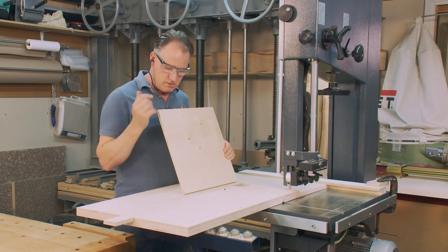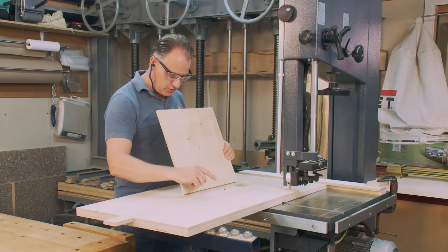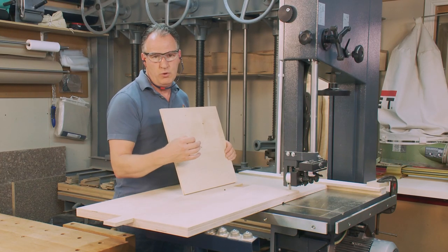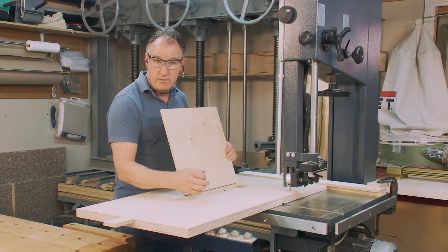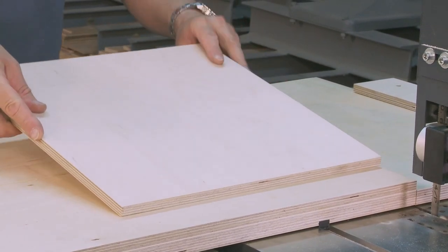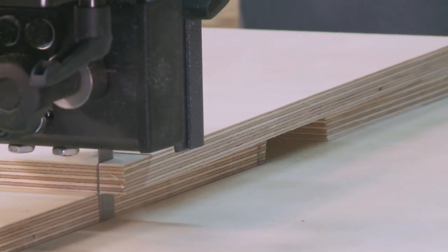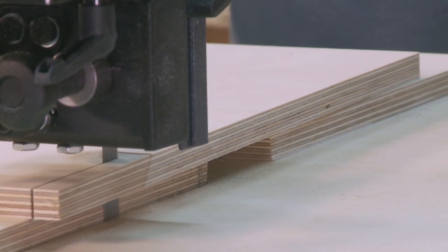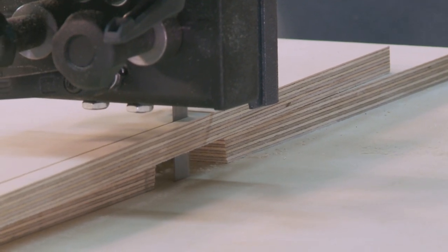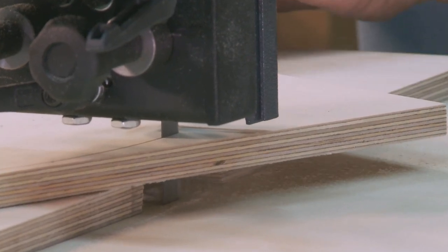This is the piece of plywood I'm going to cut. I've marked the centre and drilled it nice and square with a hole that's just snug onto my bolt so it's going to be nice and strong. If I wanted a much more discreet hole I could just do it almost on a pin head so it'll just about disappear later on. I'm going to place it onto my centre point and push it onto the bandsaw up against my stop that I preset, and then I can start spinning it and get a nice perfect circle.